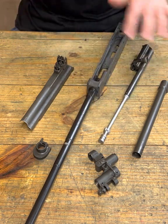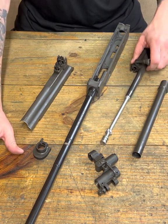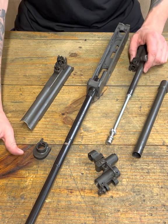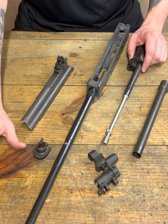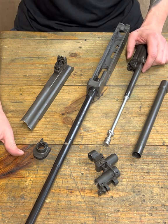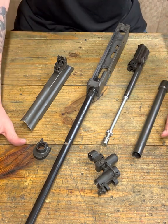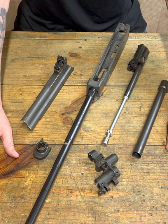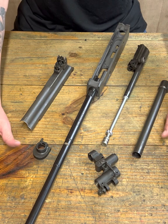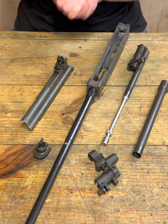What I was talking about before in the last episode, I wanted to clear up: these bolts are heat treated throughout — they're fully hardened. Additionally, the original Kalashnikov manual discusses and recommends force matching the lugs for virgin bolts as well as used bolts. It is part of the process, and I just wanted to clear some of that up.